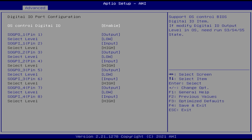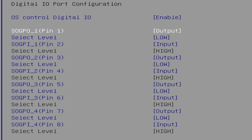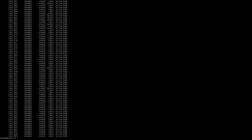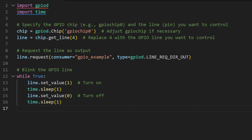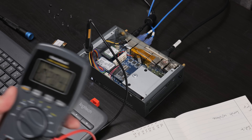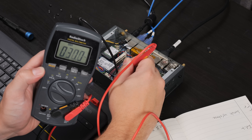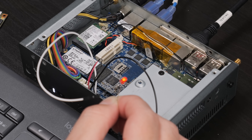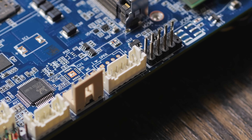To start off, I enabled GPIO in the BIOS, but noticed there were only settings for 8 pins while the header had 12. I was at least able to confirm the 8 BIOS pins lined up with the first 8 pins on the header, but when I ran GPIOD in Debian, there were 360 available lines and I had no idea what would correspond to what. I wrote a script — really ChatGPT helped me write a script — that would cycle an output pin every second, using line 4 as an example. I figured I'd cycle through all lines until I identified one with my multimeter, but the first pin I tested, pin 2, was the pin that correlated with line 4. I made a little LED flick on and off, and I'm sure there are plenty of interesting projects this could come in handy for — put your suggestions in the comments.